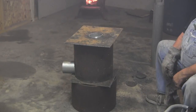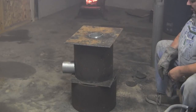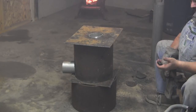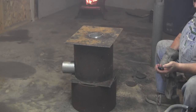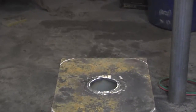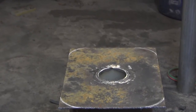Okay, there's the basic idea. I've got a bunch of cleaning up to do and I'm going to round all these corners off up top here just to make it aesthetically pleasing. I've still got a bunch of welding and smoothing up to do, and I won't bore you with the minor details. But when I've got this thing all ready to put the vermiculite in, I'll show you that, then show you it with the legs on, with some black paint on it, and then maybe cooking some burgers. I've got the pipe welded in the middle, cleaned it up with the grinder — I'm fixing to round off the corners, hit it with my grinder, turn it over, fill it up with vermiculite, and then weld the bottom on.